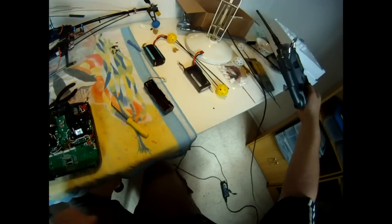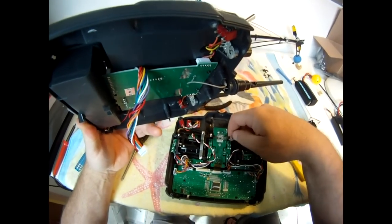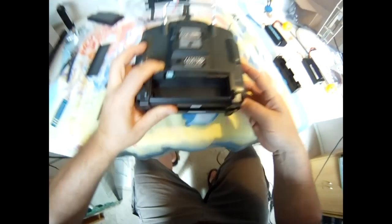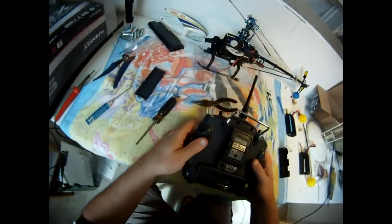Put it back together again, stick your plug on carefully. Hold it over here and when you stick it in, this little aerial here — you need to make sure that slots underneath this spring-loaded contact for the board. I usually flip that under first so it's not going to get bound up on anything. Line up the plug, stick it on, give it a bit of effort to get it in — it's a nice snug fit. Check all your other plugs are in properly and line your battery tray up with the case nicely.